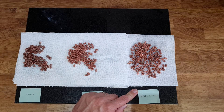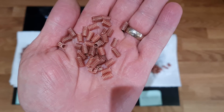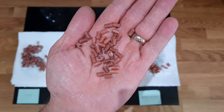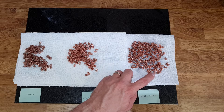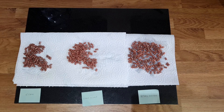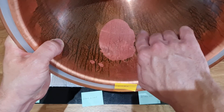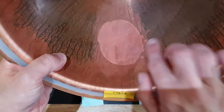What's odd is the hydrogen peroxide and citric acid — some of them are just as clean as the citric acid and salt, but other ones aren't quite there. They're not as bad as the citric-acid-only batch, but literally half look brand new and the other half are quite dark and tainted — nowhere near as good as the citric acid and salt. On the alembic pot head, the citric-acid-only did a good job but you can still see the veins. The citric acid and salt did an amazing job — it is beautiful.